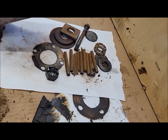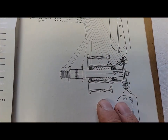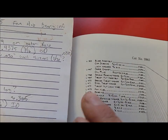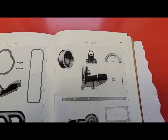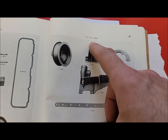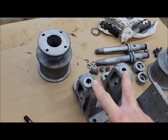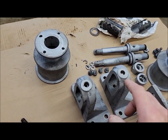There's a bronze washer in between two thrust washers — I have to see how worn out all that stuff is. I'm guessing it's probably rather worn so we're looking at new pieces. Luckily there is a very good parts breakdown cutaway in the parts manual of the fan hub assembly showing how it all goes together, with good dimensions and sizes of all the parts. You can reference the numbers and it gives more information for each individual part and washer. The only part I'm really missing is the knob and correct stud that go into the top to adjust the fan belt tension — there were just random bolts in there, not correct.